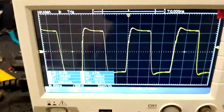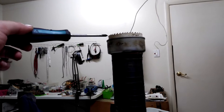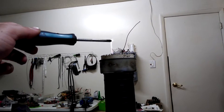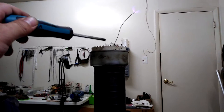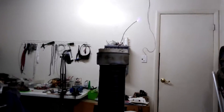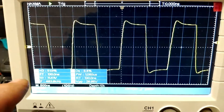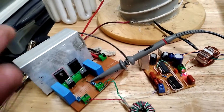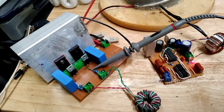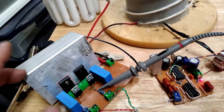I've got it on the ZVS supply now — it's ringing really bad. I'm kind of just figuring this out as I go. From what I can tell, I'm getting what appears to be a decent switching waveform compared to what it had before. The only difference I notice is less output — it's just not outputting like it was. What I've noticed since making these slight adjustments is the heat sink gets incredibly hot now. Before it wasn't getting warm at all — I could run this thing for hours and the heat sink would be hardly warm to the touch.